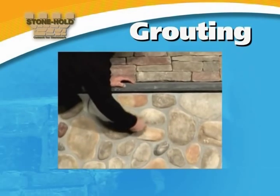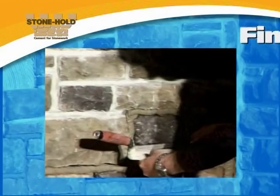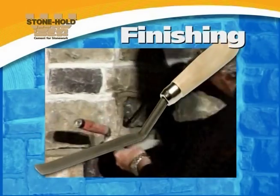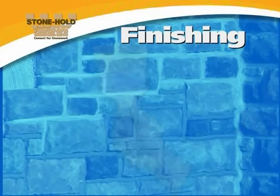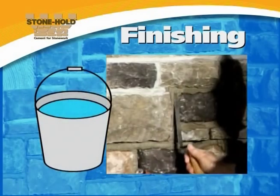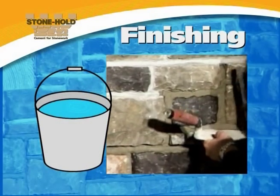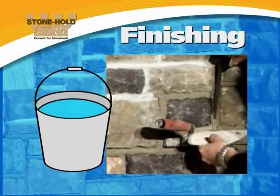Use a dry brush to smooth out the wet grout in the joints. When the grout in the joints is thumbprint dry, finish the joints with a metal slicker tool. Avoid scratching the stone to avoid damaging the pigmented surfaces. For finishing, some craftsmen prefer a stiff paint brush. Avoid wire brushes — they may damage the stone surfaces. To seal joints, add a little extra water and compress each joint. This provides a smart finished look as well as a first line of defense against moisture penetration.